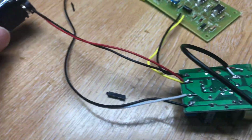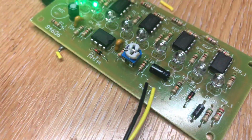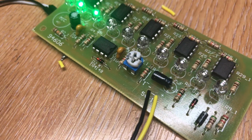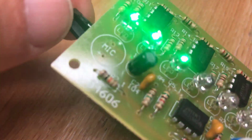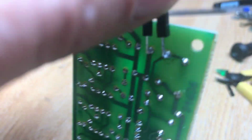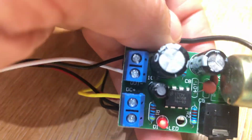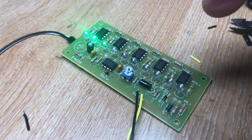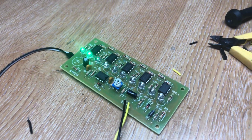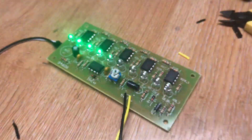So really simple circuit, 6 volt battery, power the amp, piggyback off the amp and into the audio board. Obviously remove the mic, and then again on the underside of the tracks, tack 2 connections, and we've put that to the output of the amplifier. So you can adjust the sensitivity of the amplifier that I'll be picking up my phone. So basically this is like an EMF detector.